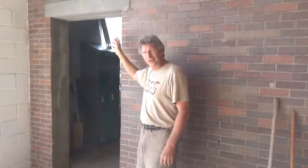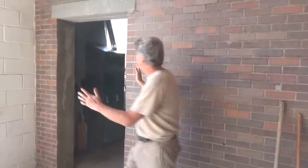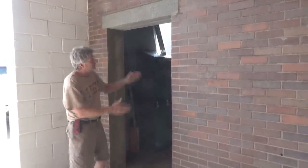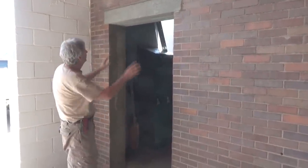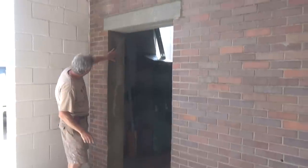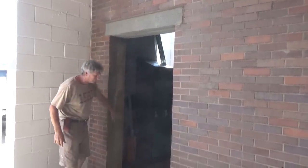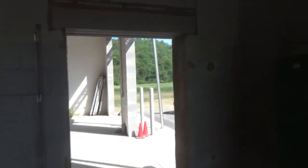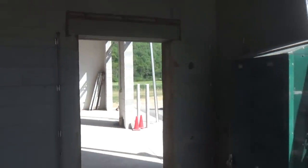I just put in this door opening — it went through a brick wall, and then on the other side was blocked. So what we did was we sawed it out, and then we got lintels and put them on top. One thing I didn't show you when I was filming is I was throwing cement down from the top to fill this in. We're on the other side and it's kind of bleached out because of the light, but this is block and we got our lintels in. Now this door is going to be completely open — they're never going to put a door on it. It's going to be a passageway.